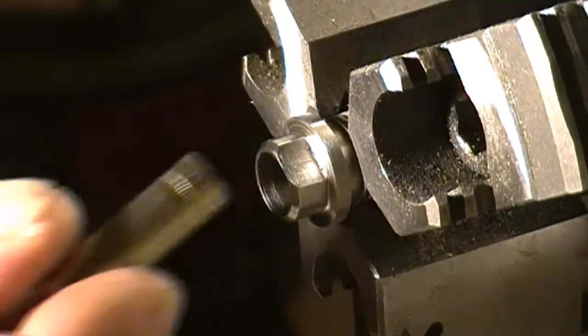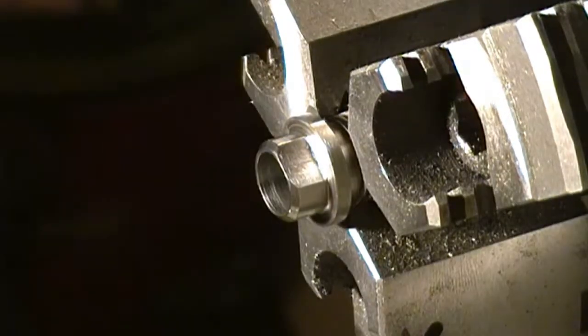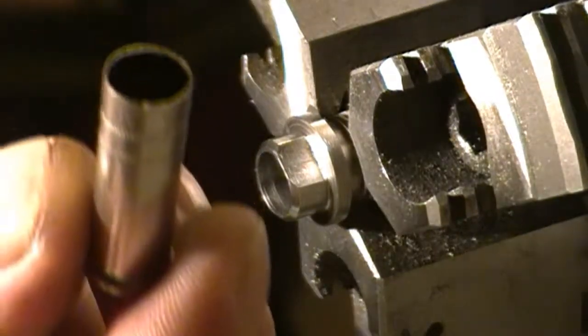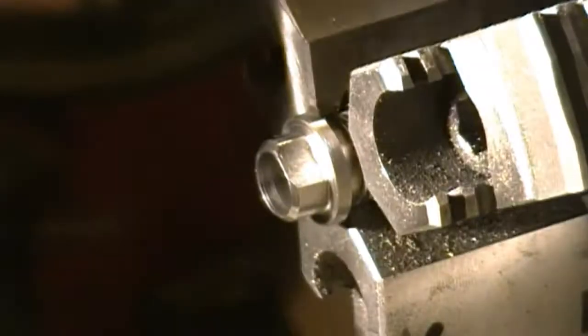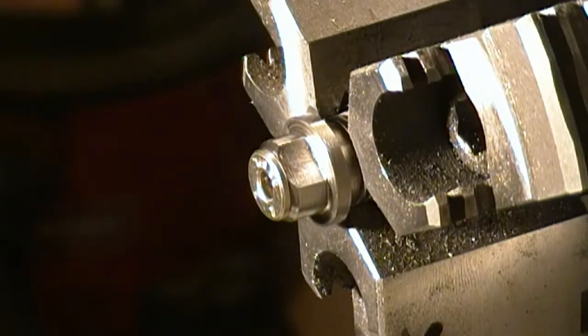I polished up the bore and there's no wobble whatsoever in the brass. The one problem is the brass is too long, so I took a piece of 38 special brass and trimmed it down to just shy of the length of the breech plug. In the following video you'll see some of the steps taken to make this. We now have our ignition system upgraded to a small pistol primer, and what this does is allow your powder charge to sit right on top of your ignition source with no air gap and nothing to cause any delay.